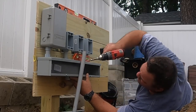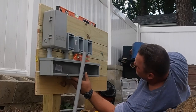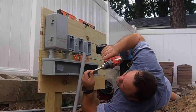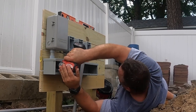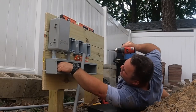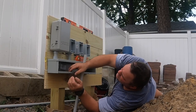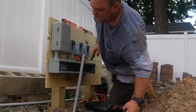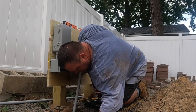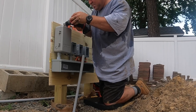Of course you wouldn't mount any equipment without it being level, but I'm having a hard time with the screws because I'm using stainless steel. Around a swimming pool with chlorine, I see guys using sheetrock screws sometimes — I don't get it. I try to go above and beyond what's required. Stainless steel screws don't rust, but you can't magnetize them, so they fall off your drill bit. That's what I'm struggling with there, but once you get a couple in, it makes things easier. It was about 90 degrees that day — a very hot day.